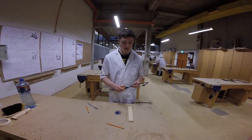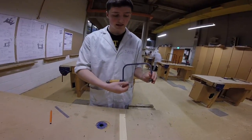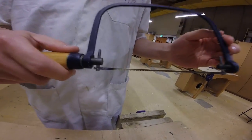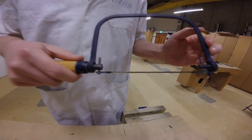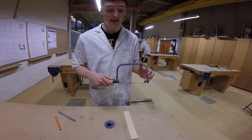I'm going to show you how to use the coping saw. This is my coping saw — I have my handle here and my blade here. It's important to note that the teeth on the blade are pointing back towards the user, so it cuts on the pull cut and not the push cut, which is what happens when you use a tenon saw.